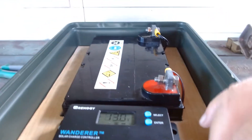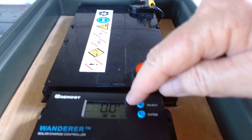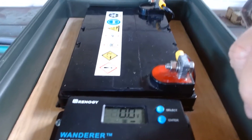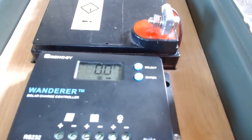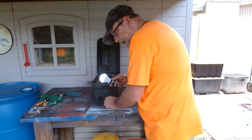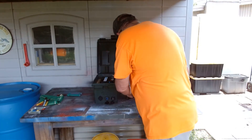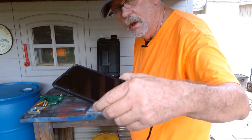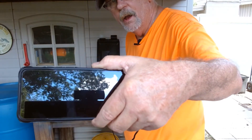You can see all your wires are underneath the top deck that we made to hold the battery in place. Your charge controller is displaying several readings — amps, volts, power on and off. The 15 is the power on and off. So we can actually plug something in here and see if it works — the power is on. Let's hook up a light into this 12-volt jack and see if it works. Got me a little 12-volt light — and bingo, we have power. Now let's hook in the USB. Let me plug up my phone and see if it starts charging. There we go — it's charging. It's definitely charging. So we know these work.